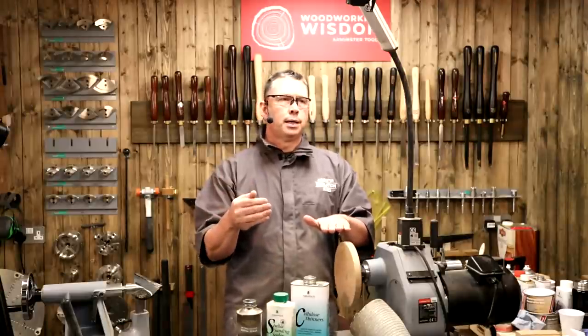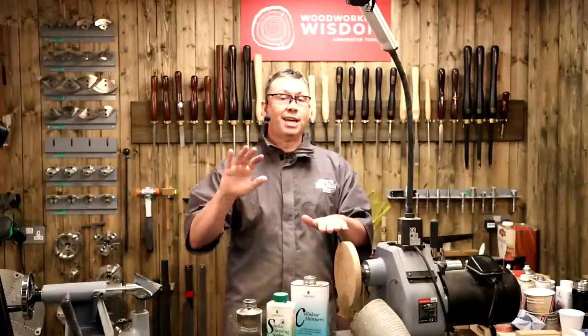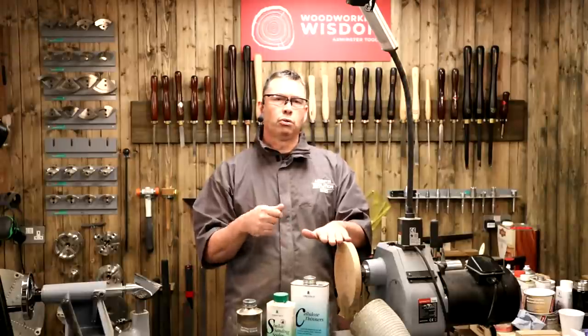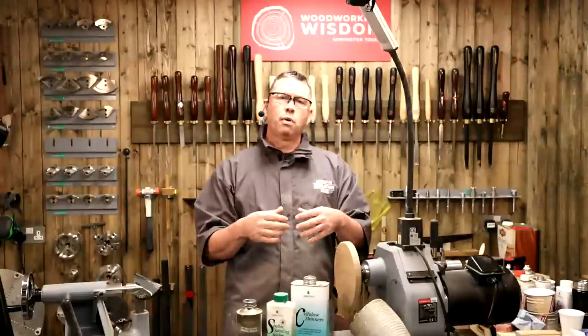If we apply a stain, it's not going to penetrate. If you apply an oil, it's not going to penetrate. So they can't do their job, so it's not right for those. But if you want to apply a polish or a lacquer or a friction polish, those sorts of things where you want a high build shine, it's quite important.